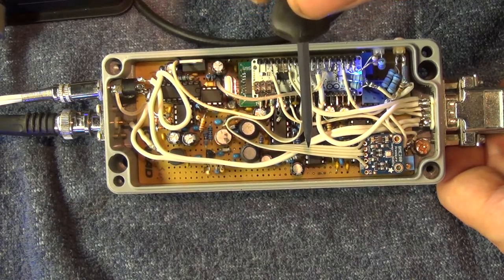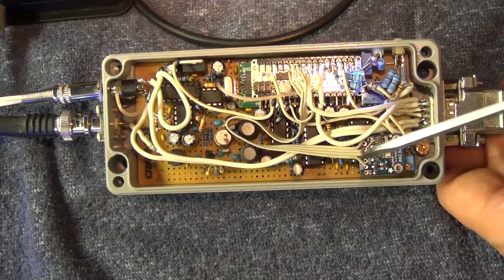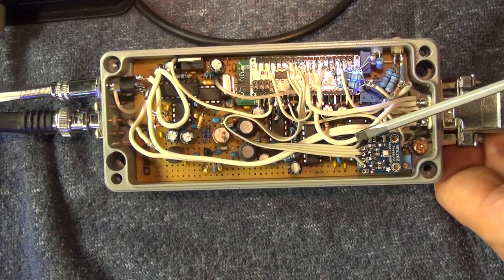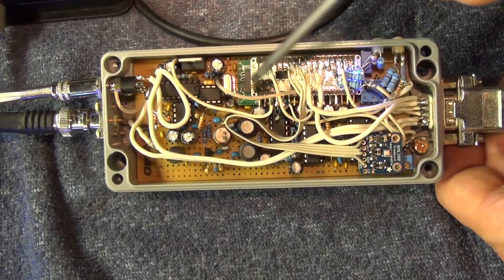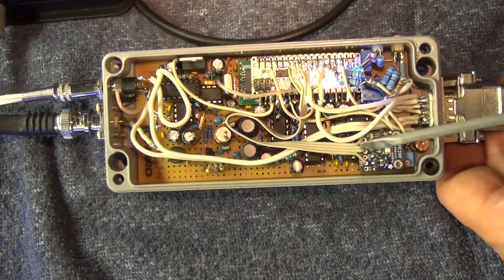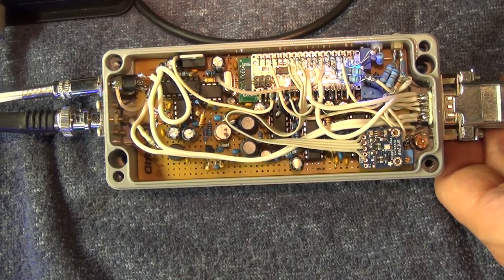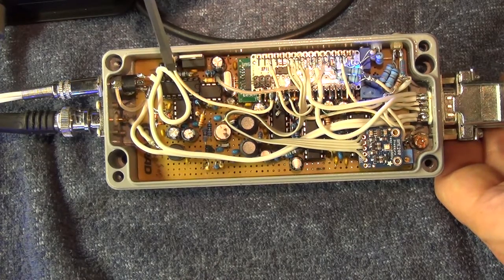This is phase shifted by 90 degrees and mixed with an analog switch here. And after that, it's filtered and added again. And so from the 500 kHz which goes in here, the 400 Hz stays off, which I had offset from my frequency generation. Then here this part is just an amplifier — a very, I think, 100,000× gain.